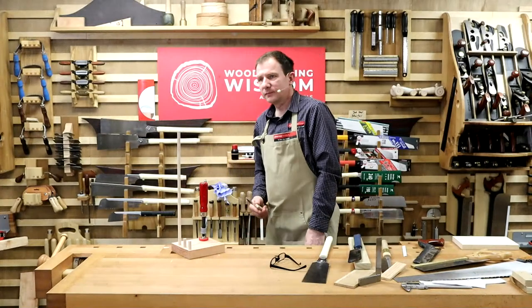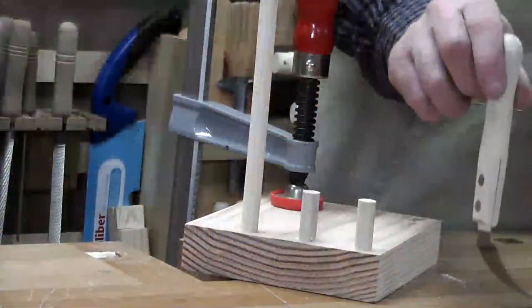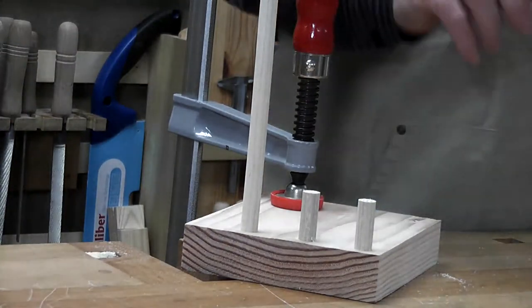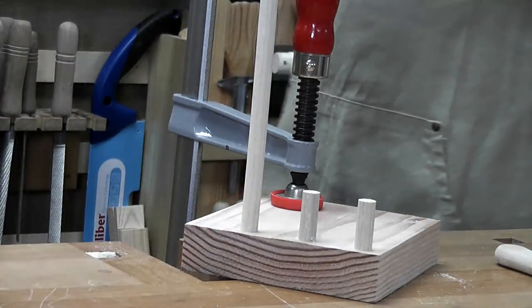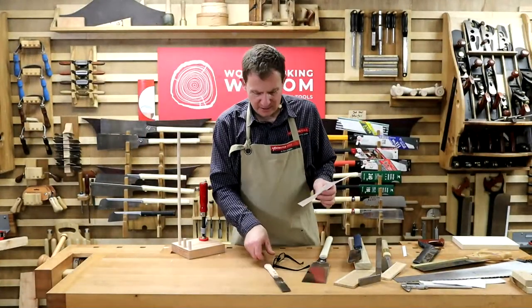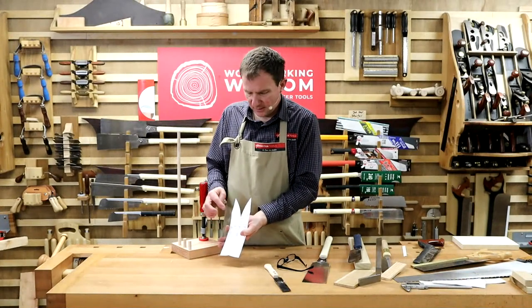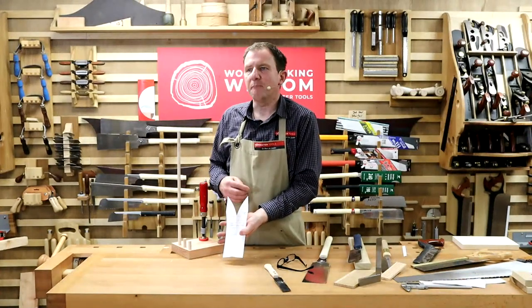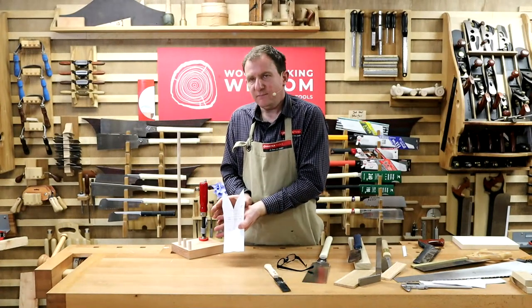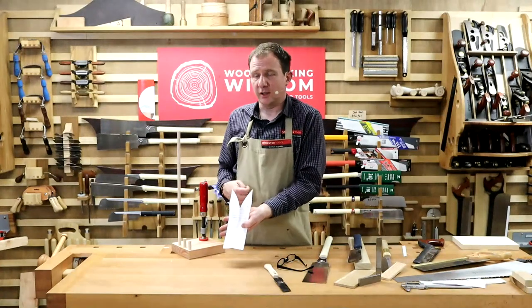All right. Okay? Good. Right. So this one, get this for a saw. Flush cut saw. And it does do this. Look at that. Now, this has no set on the saw at all and no kerf. Most saws, if you look down the section of a handsaw, have the blade and the teeth that are bent out alternately. That's the set. If you measure across the width of it, you get the kerf, from the two points of the teeth bent out alternately.